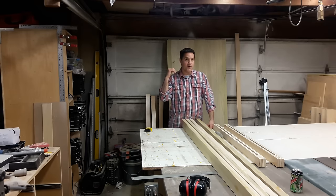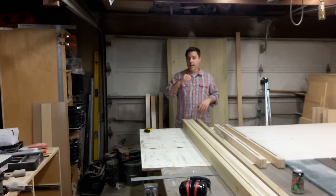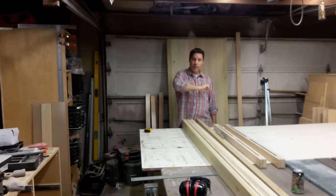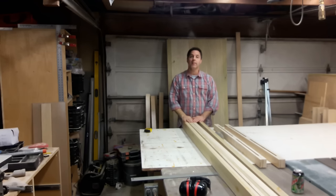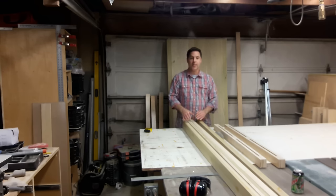What I'm going to do is stain these panels first and put a coat of polyurethane on them. If you've ever stained cabinet doors or painted the six-panel doors in your house, come winter time it gets really dry, the wood shrinks, and all of a sudden you see a line of bare wood along the edge of some of your panels. This is because of expansion and contraction. I don't want them to expand and contract sufficiently to start showing a little bit of line where we didn't catch stain.